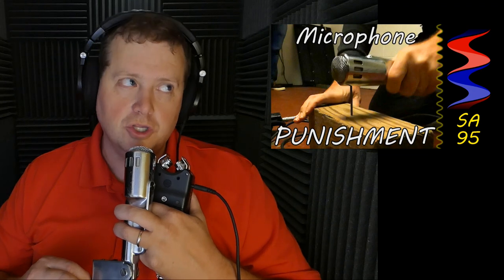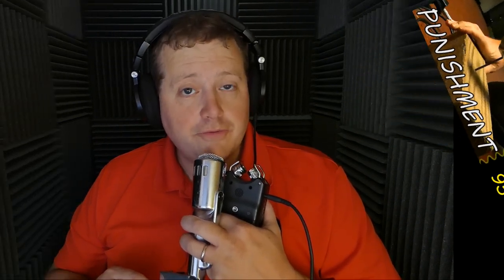Now that this test cable is ready to go, I know which pin is which on my test cable and where it plugs in on the microphone. I highly recommend taping over any pins you are not going to be using as part of your test. I'm simply going to plug it up and activate the microphone so you can hear it. You can tell this microphone is working and it's actually sounding pretty good. Once you've bought the microphone, make sure it has a good quality cable. For the EV664, I cut off the Amphenol cable from the old dry rotted cable from the 60s it came with and converted it from the original garbage cable to a star quad cable with a low impedance connector.